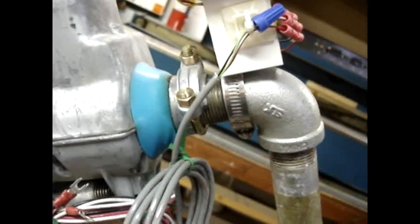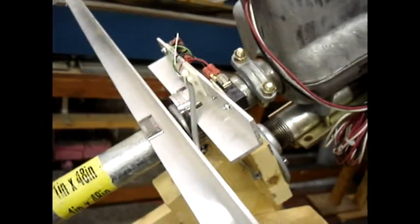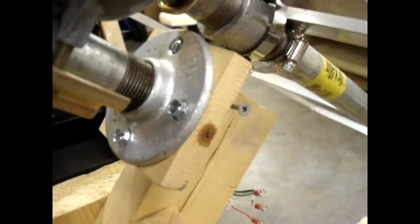The sensor head is mounted onto the pipe with a piece of square aluminum and a hose clamp — that works pretty well, good and sturdy. The limit switch bar has two limit switches mounted on another piece of aluminum angle, with two momentary-contact limit switches. The paddles on the limit switches hit the screw heads sticking out on the wooden mount at the extreme ends of travel. This is the east side, so this is as far east as it goes in the morning. Over here in the afternoon, the west limit switch contacts the screw head and stops motion at the far west end of travel.